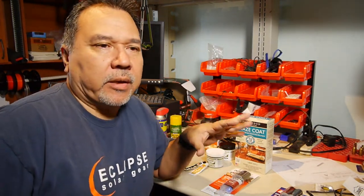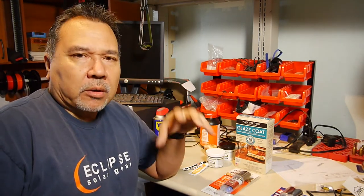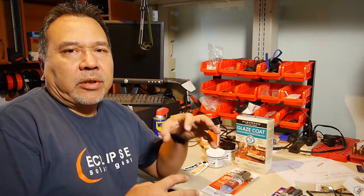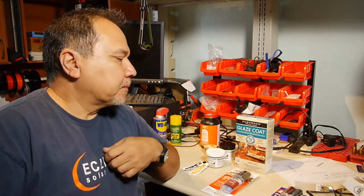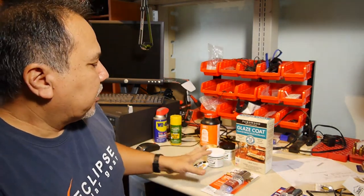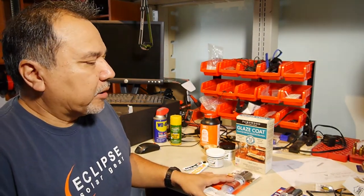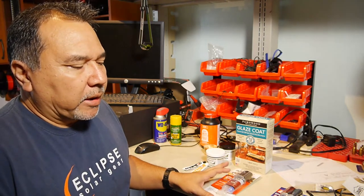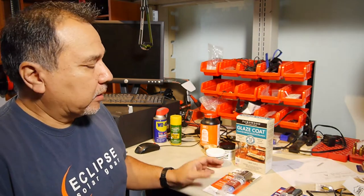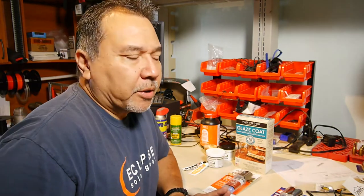For the most part, there's a lot of bedding materials out there specifically for it. They're all epoxy based. Some of them have fiberglass resins and dyes so that you can match the color of your rifle. I've never used those. I've always turned towards just a regular epoxy based formulation, knowing that I can still add dyes, pick the colors or whatever. Sometimes I just go with it clear since it's going to be in the rifle anyway. That's personal preference.